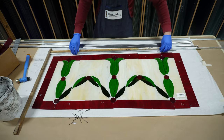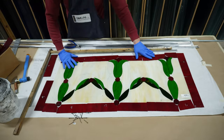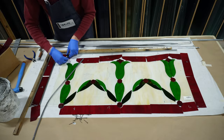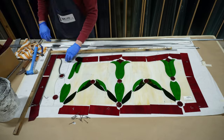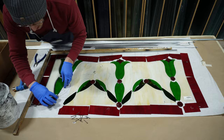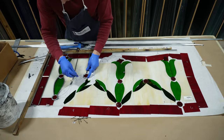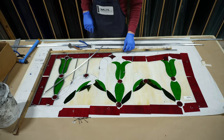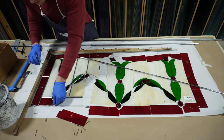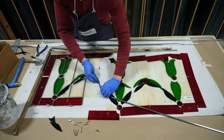First we will be starting with the perimeter, pushing the cut glass aside to make room for our first piece of the half inch zinc. Normally it is best practice to use a miter saw for more clean cuts, but I wanted to show you that with a few beginner tools you can build this entire window without needing to purchase an expensive zinc miter saw. The area of this window is all a 7/32 inch round H profile lead. This is our most typical setup for new windows, but we stock over 50 different metals including lead, zinc and brass. This helps us emulate different effects with different profiles and even with historical restorations — whenever we need to match the profiles of lead on a national historic property, we almost always have everything we need.